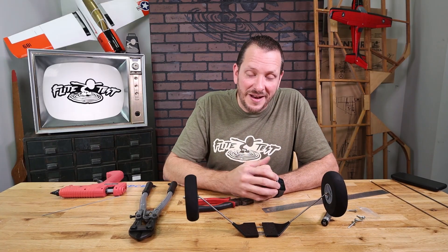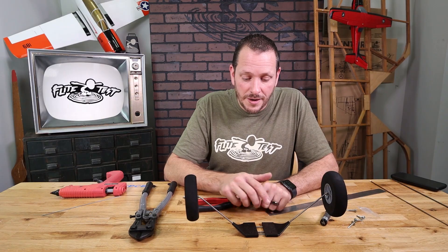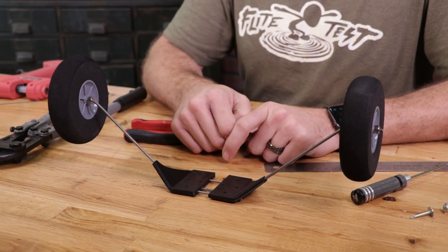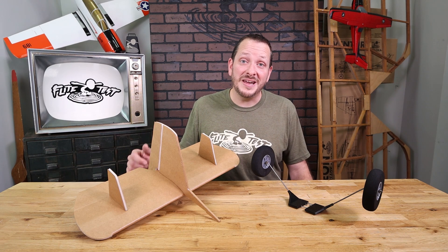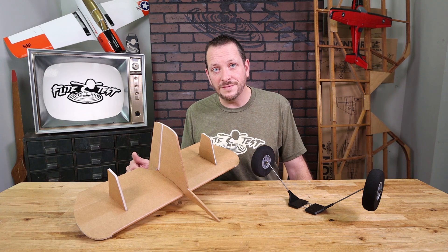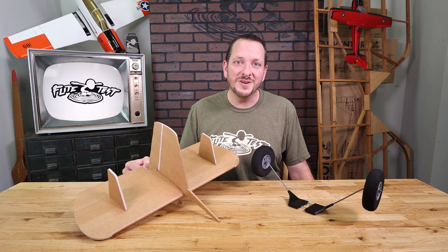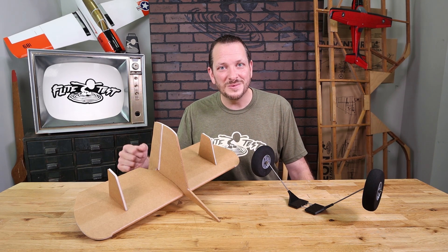At this point, our landing gear is ready to mount onto our FT Legacy the same way the build instructions show you — simply four screws to screw in. We also included some extra holes, so if you ever want to change from plane to plane or add some extra strength, you can add extra screws there or even hang an accessory. All right friends, the three main components of the new version of the FT Legacy are now done. Please feel free to go back to the original build video, and whenever you come across the tail, the elevator, or the landing gear, you'll know exactly what to do. We're really excited to see these in the air. We'll see you next time.